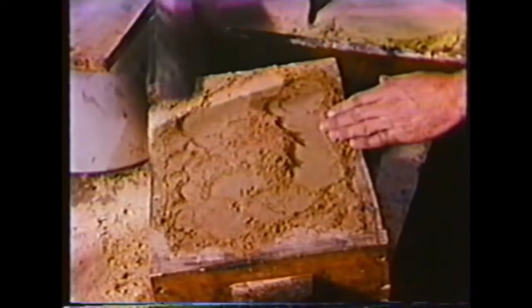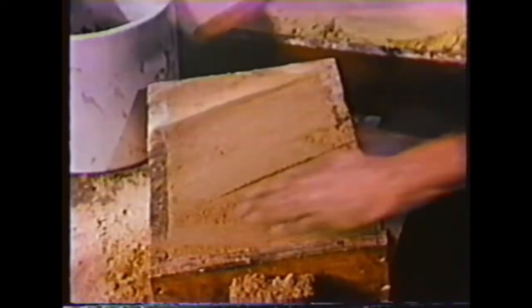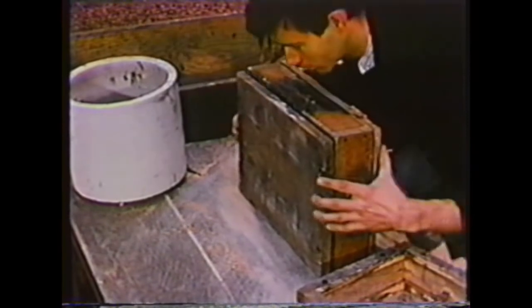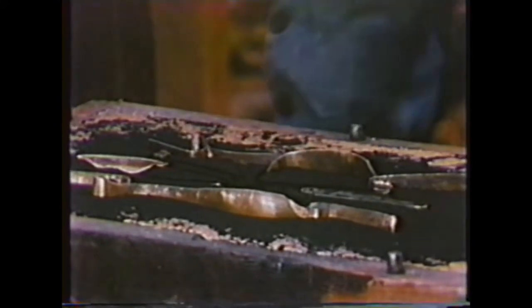The first sand is called facing sand, which is a very fine sand mixed with powdered charcoal — this is only used over the patterns. The fill sand is much coarser. Both sands are bound with water. This forms the bottom half of the mold. Once the bottom half is packed, it's turned over and the matchboard removed. The patterns usually come out with the matchboard and have to be placed back in the cavity before the top half of the mold can be made. Parting powder — I use ground soft coal — is used to keep the two halves of the mold from sticking together. The parting powder is cleaned off the patterns.